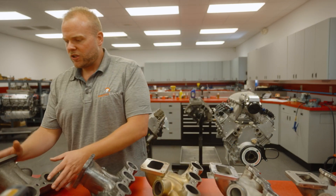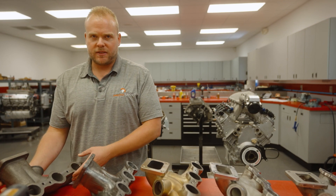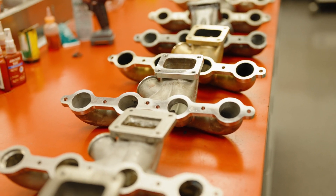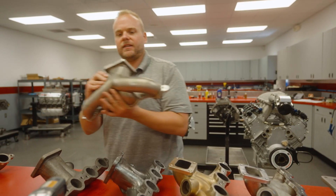The next iteration we actually had cast in ductile iron. Now we wanted to release these manifolds in ductile iron, but it turned out we couldn't get the precision we needed in that material, so we had to switch to stainless. We chose 304 stainless cast, which ends up with a finish looking something like this.